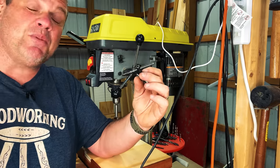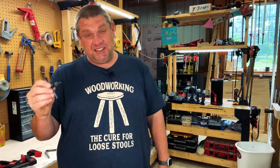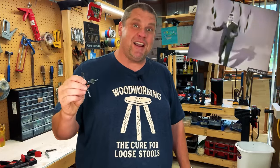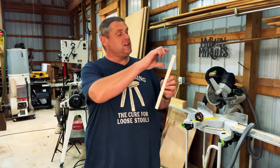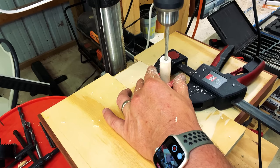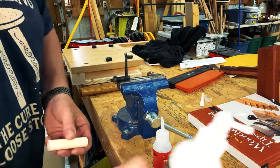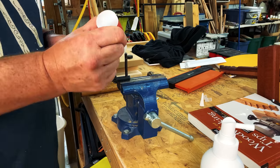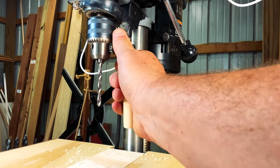If you're anything like me, you hate chuck keys. These things are really small, always get lost, and can be very difficult to tighten down, especially with something like arthritis. So why not make this thing bigger and easier to twist? I've got a pine dowel from Walmart in a set of three for less than two dollars. I'll cut a three-inch piece, drill a 15/64th-inch hole in the center, add CA glue to the key, put activator on the dowel, and tap it into place. Now I have an easy-to-hold chuck key with a lot of leverage.